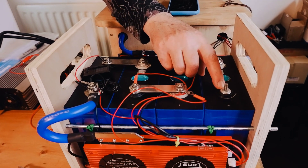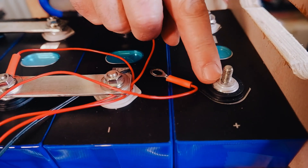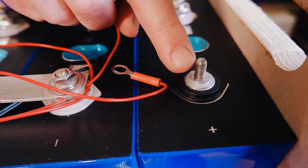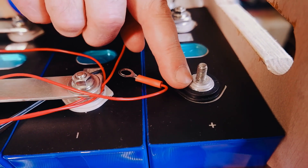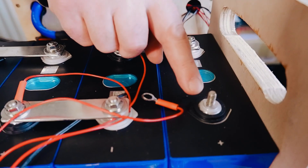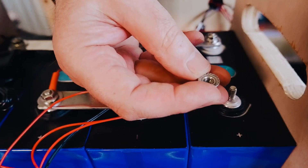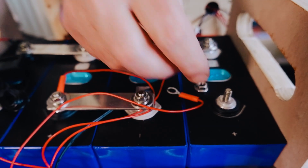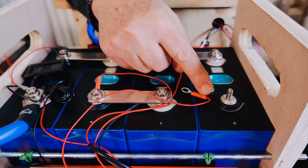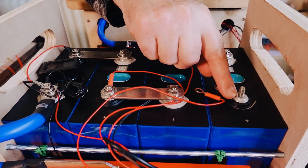I've taken the positive cable off and the balance lead off. This is the more modern way of doing these terminals with a laser welded stud — you can apply very high torque. There was quite a lot of discussion on the forums around the tiny surface area, where the cable lug and bus bars sit on this tiny surface area, clamped down with a 10 millimeter thread. The supplied nuts are stainless steel, and the seller's suggestion was to torque them to 10 newton meters, which is quite a lot of pressure. Despite concerns about the surface area, it was absolutely fine.